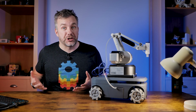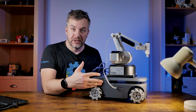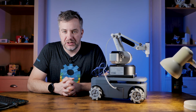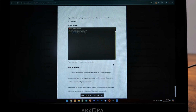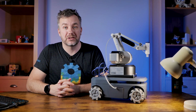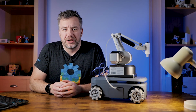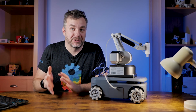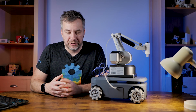According to the instructions I used to connect the arm and try to execute the movements from the Jetson Nano to control my arm, I needed to elevate the permissions. I wasn't particularly happy about it because something didn't play nice, especially if I wanted to use my blocky interface to program the arm as well and switch over between Python, I needed to run it as an administrator. That was kind of annoying, so I've included a fix for that in the article as well, so you can elevate the permissions for the user, and that will help you run everything as normal without extra privileges.